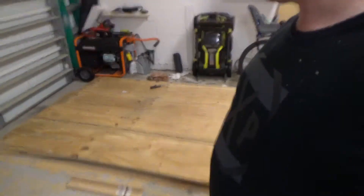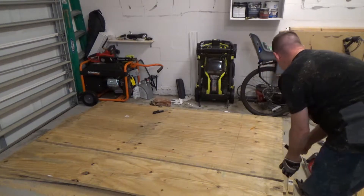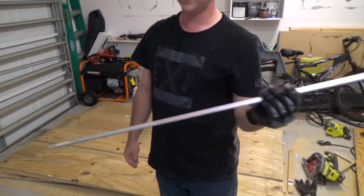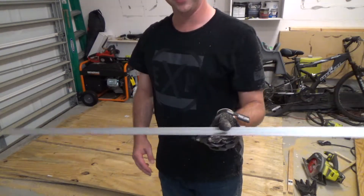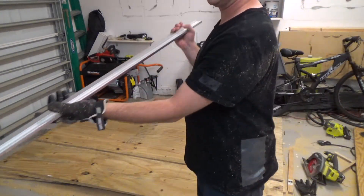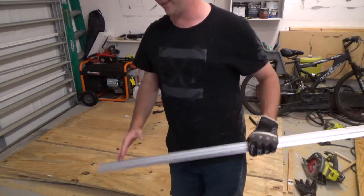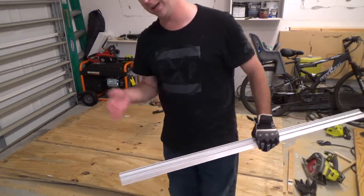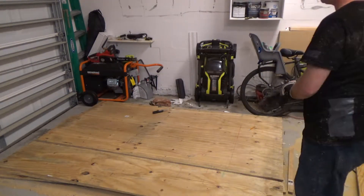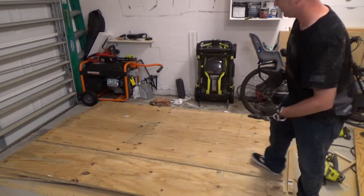There are a lot of different ways to cut a straight edge. What I tend to try is using these steel straight-edge pieces — you line them up on your wood and clamp them down. The problem is these things flex a little bit. Even when you clamp them at both ends it can flex, and that's when your saw binds and you don't get a straight edge. Since I'm using giant heavy three-quarter inch plywood, the best option is to use a big heavy piece of three-quarter inch plywood as my straight edge.